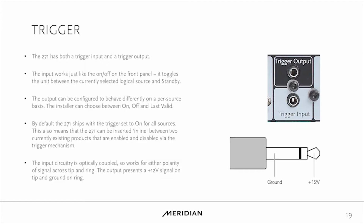So what we've done to combat that, I mean, in some installs you have to put all sorts of chokes and all sorts of protection mechanisms, but what we've done is we've found an Ethernet connector that includes all the magnetics in it. So this stops all the EMC and interference right where it's connected, so it doesn't get injected into the circuit boards, it doesn't get into the power supplies. So from the installer's point of view, hook your network in there, you don't even have to think about it because we've dealt with all of that for you.